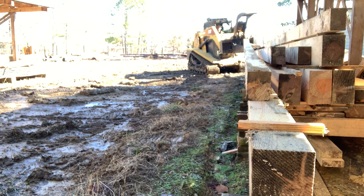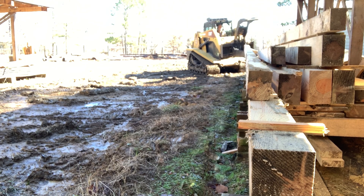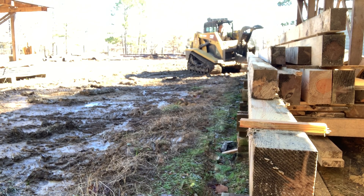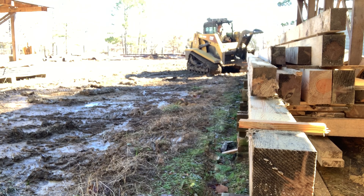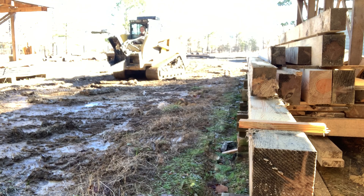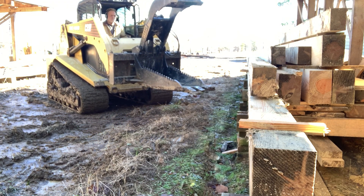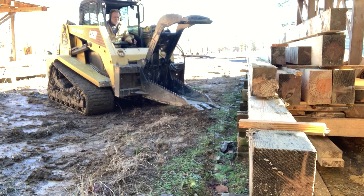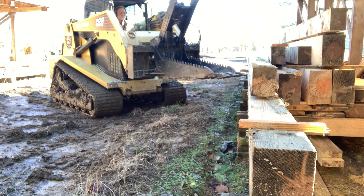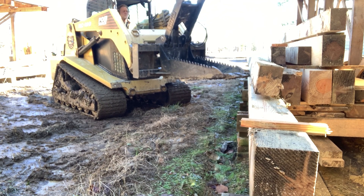Watch this technique — look at that roll. You can't beat that. It's just dumb luck but it worked out. Come grab it along the center line and ease it forward, get it up on these other stickers. Then I go back in and finish edging out my other material. I've only got about six more of these long logs to cut and I'll be ready to start stacking out my logs on the cabin itself.